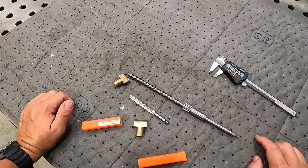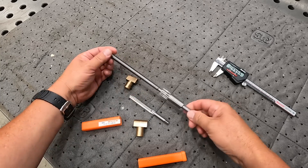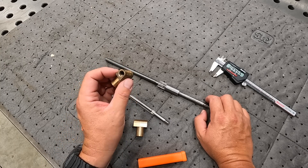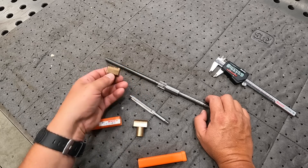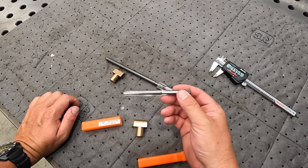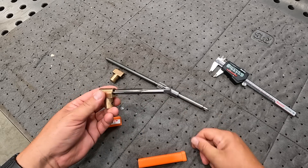We're getting about 14 or 15 thousandths play in there — that's really not too bad, but I understand it has some wear. When you have all this together and you're turning the handwheel, you want to try to clean up as much of that backlash as you can. I've never worked on a South Bend lathe, so I don't know if there's a way to take up the backlash — I don't think there is. So what we'll do is take this tap and run it through the new nut, and hopefully that will clean it up to where the lead screw will actually thread through.